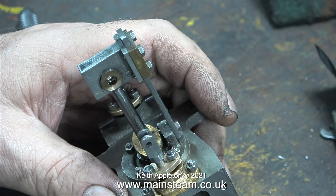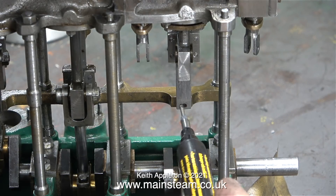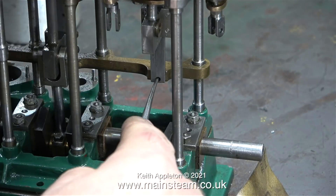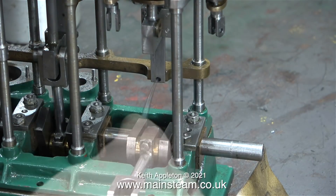With the crosshead at the full extent of its travel, it's now time to find the final position where the guide bar mounts to the long bracket on the side of the engine. As you can see it's not lining up very well — this is partly due to the fact that the hole in the guide bar isn't exactly in the centre, which is what I was talking about earlier. I'm holding the cylinder casting in the perfect position and using my felt-tip deep hole marker and my scriber to make sure the hole I'm going to drill is in the right place.